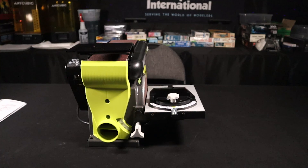This knob here is called your tracking knob. If you're sanding and your belt is starting to slip either way, turn this knob a quarter turn — it doesn't tell you in the directions which way. This is going to either pull it out to make it tighter so it stays on the drum, or loosen it up because it's too tight. You may have to play with this on your first sanding.